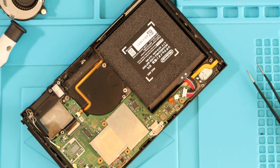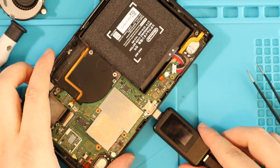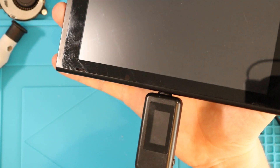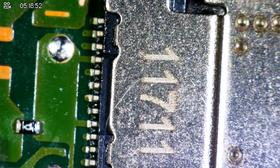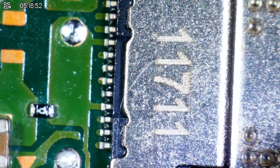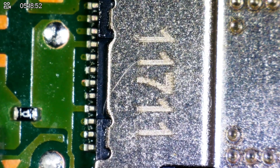I'm too nervous — I literally don't want to do it. Here we go. Nothing. What about the other side? Nothing. Let's take it apart and redo it. My guess is that it just didn't get hot enough underneath on the other row of pins. So instead of just tinning these up, I'm going to put the hot air station back on, give it another blast, push down for a little bit more pressure and see what happens.